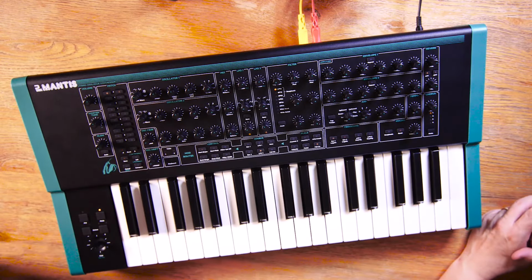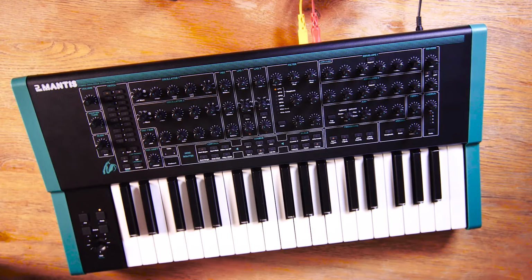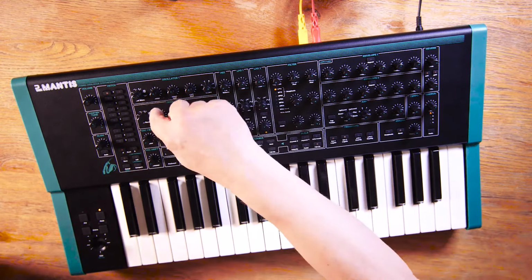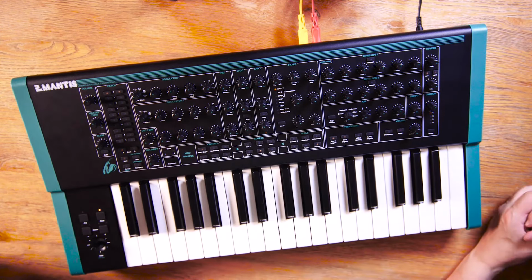Yeah, the oscillators are derived in a similar way as the Wasp would have been. It's all modern electronics now, but it's where Chris wanted to take that voice generation into the next step, and then we've paired that with the dual filter that is found on the Oscar that is not really found on very much else, and that's what gives it its unique character. So it's the greatest hits of the two, but then there's some extra PWM-ness that we've added, Ben and I, around the oscillator generation and the shape. We've done some extra stuff there as well.